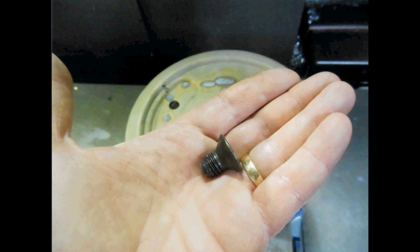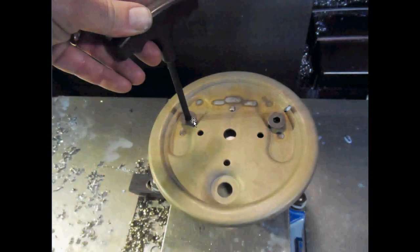That's a great little thing I've discovered over the years. Flatheads will really locate a part because they're self-centering. So as long as you get your holes in the right location in your fixture, the angles on these heads will basically self-center into where you need. So now I've solved two problems here. Let's take a look at how we mount it. So I put the 2 screws in. That's tied it into that dowel pin.